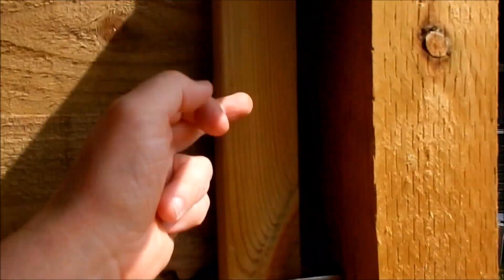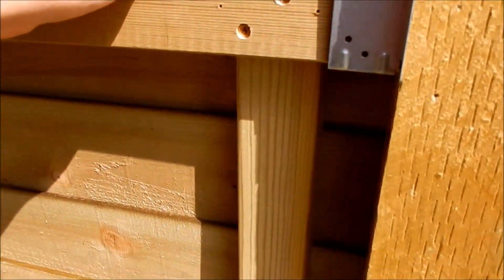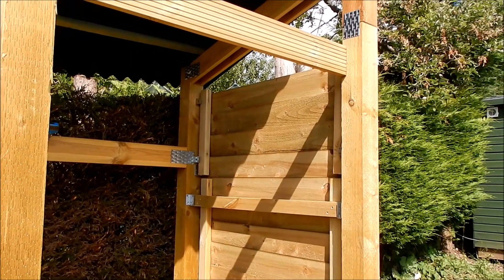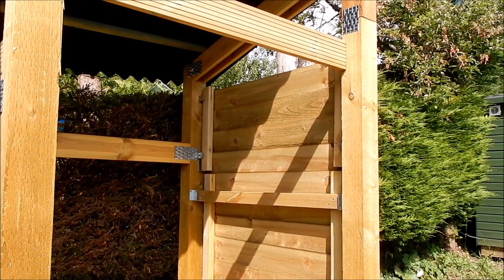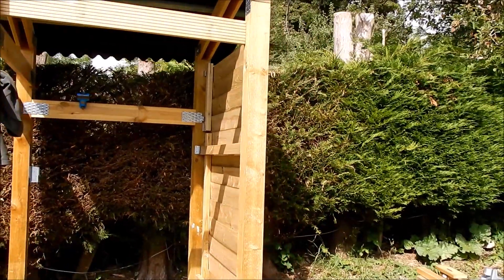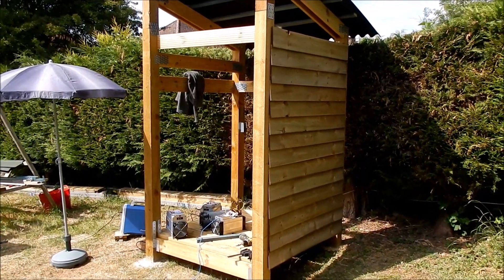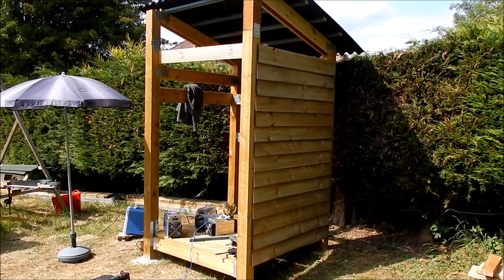The combination of a lifter and a couple of pullers works well. To do this in sections — the lower section is quite heavy because it's quite big, so if I do this again I could make that perhaps two sections, giving a wall made of three completely separate sections. It just means having a lot more of those brackets. But bear in mind if this wall is moved to a place where I think it's going to be a permanent placement, then all those brackets can come off and I can just screw it straight into the fence posts and have all my brackets back, because I don't like having too many brackets in use.